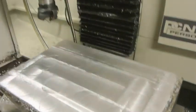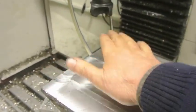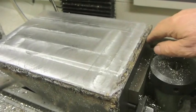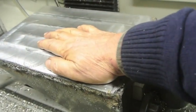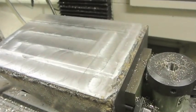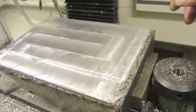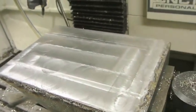The next process will be to machine a datum along this edge so that I know I've got a square surface here, and then I've got to think about machining this surface square to this. So that's the next step after I've got a datum to work from. It's a big piece of metal, really big, so I don't know exactly how I'm going to machine that bit, but I'll figure something out.